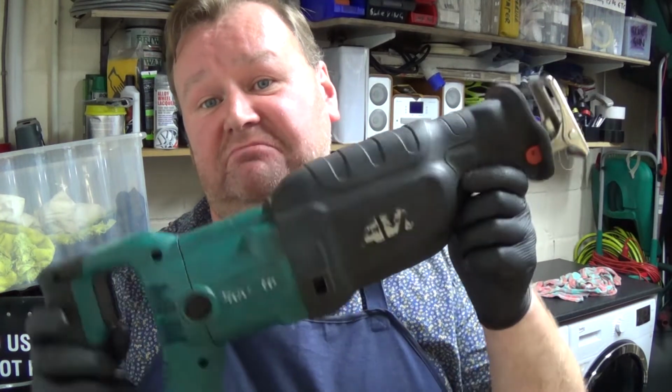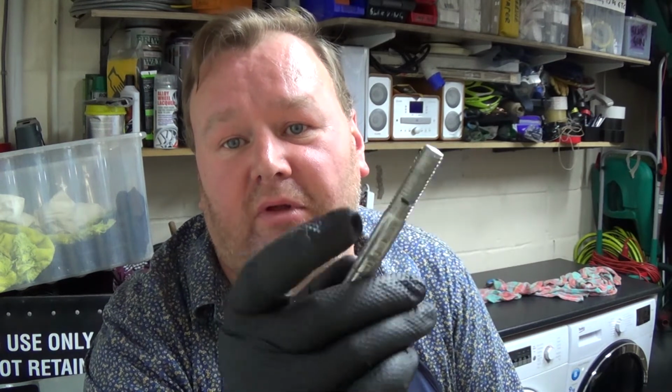Okay then, well, there it is. It appears to work. Whether the fault was the oil contamination on the flywheel, clutch plate, whatever it's called, which there did appear to be, whether it was a fault of the foot being loose, although I doubt it, I don't know. I wondered if, when I tested it out initially on this bolt, the saw blade was able to grab against those threads and cut part way through, even though it didn't work very well. But then when I tried it later on, having supposedly fixed it, I was actually on this smooth shank bit. Maybe it can't deal with that sort of stock.